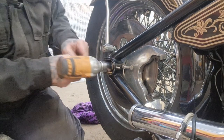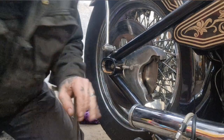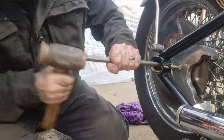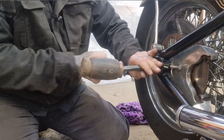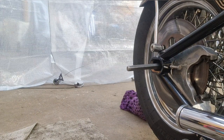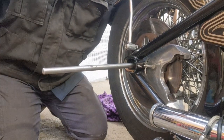I've already cracked this undone, so another nut off - a flange nut. Just wanted to say flange. And now we'll tap-tappy-tap this. Fucking handlebars turning. I think I need to get a longer drift - although I might manage off camera to get the spindle out. Nah, I need a longer drift. Proper. Support the spindle on the other side and there we go.